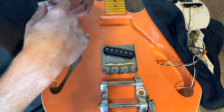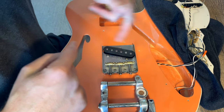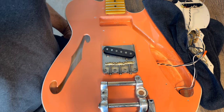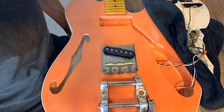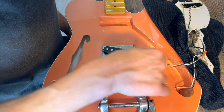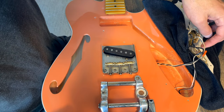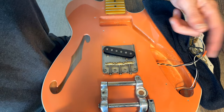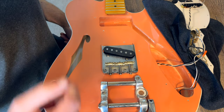If you think of it as a sine wave — maybe the black is going up when the white peak is going down — they sort of cancel each other out, kind of like an out-of-phase thing. I don't know all the science behind it, but based on others' experience and people smarter than me, it helps. On the bridge pickup I sort of lost the coils, but I'll try to unsolder those wires and coil them around each other, which may get rid of some of that noise.